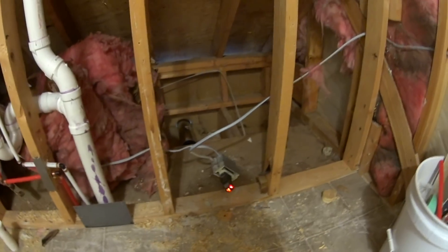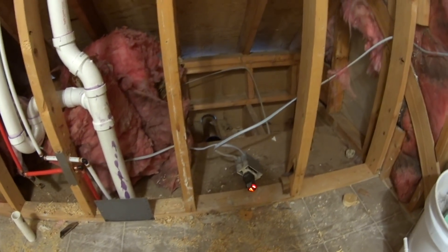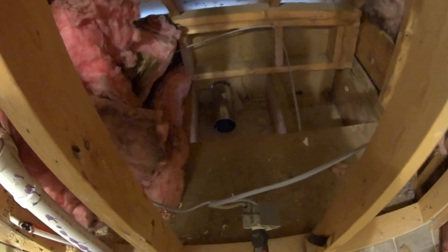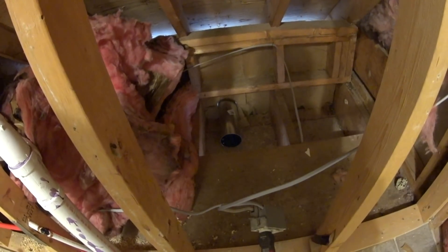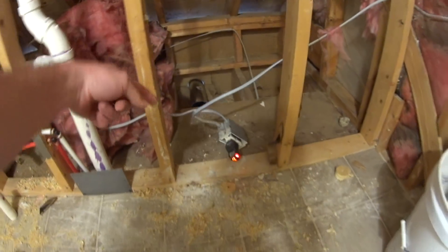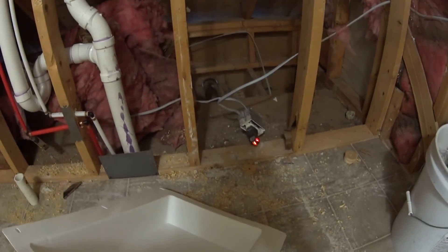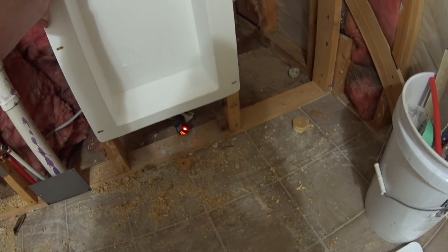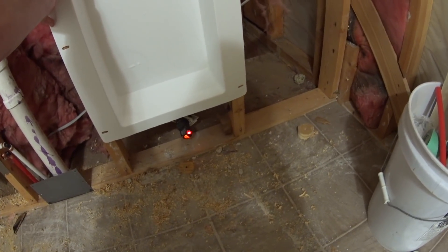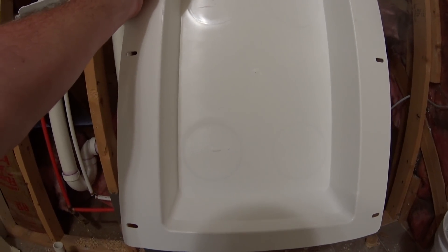I had the contractor that's doing this remodel job with me when I got here, and I didn't want to be rude. So we've already got the vent cut through the outside wall. Basically, all we need to do now is route it up and bring it here. We're using this dryer box provided by the contractor, and that'll mount between the studs a few inches from the floor. We're going to come straight in from the back, and I think we're going to use this left low knockout to bring the pipe through.